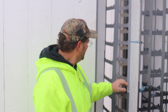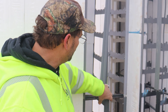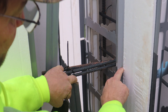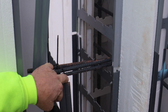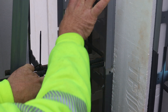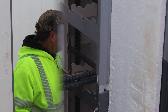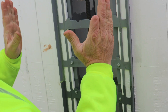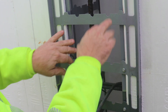Here we have a T-intersection. A groove is cut in the face of the panels on one wall, and a plastic stud is stuck into that groove and screwed into the plastic studs on the opposing wall. Typically the T-intersection gets built first ahead of time, stood up, and then you build off from it in each direction. You can see clearly how the plastic studs are set into the groove in the foam and then screwed to the opposing wall.